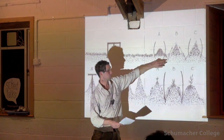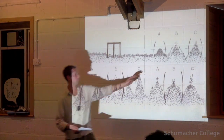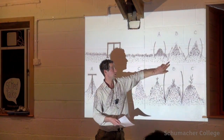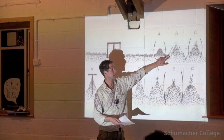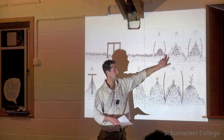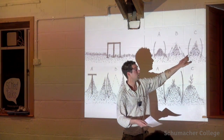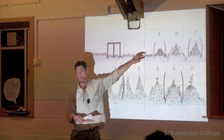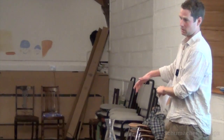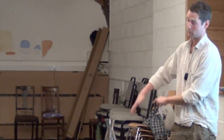Once you've gone through with the discs, you make up a rough ridge of all this scarified organic matter. Then you do a second pass with what's called a subsoiler — simply a single blade that goes right through the soil, to a depth of about four inches on either side of the ridge. What that does is let air and water get down, and also loosens up the soil on the shoulder of the ridge. Then an additional pass with the discs picks up this loose soil and throws it on top of that row of undecomposed organic matter. Essentially, what you're creating is a wind row — a long compost heap.